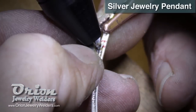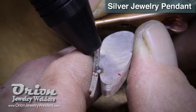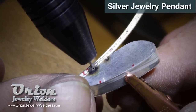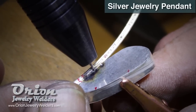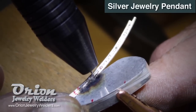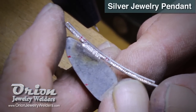The metal I'm working with is the new Continuum from Stuller, which is palladium-based sterling silver. The settings are 13.9 watt seconds on energy, micro range, 8 millisecond weld length, no agitation, standard ignition, 1.7mm diameter weld spot, and 0.7mm weld depth.